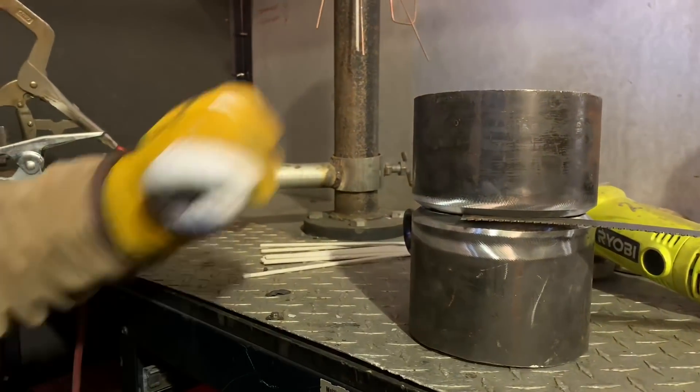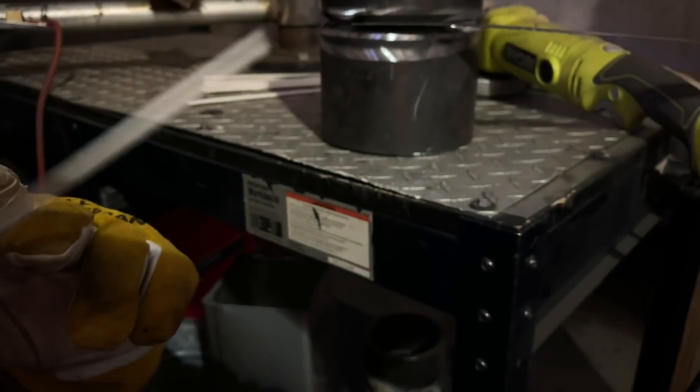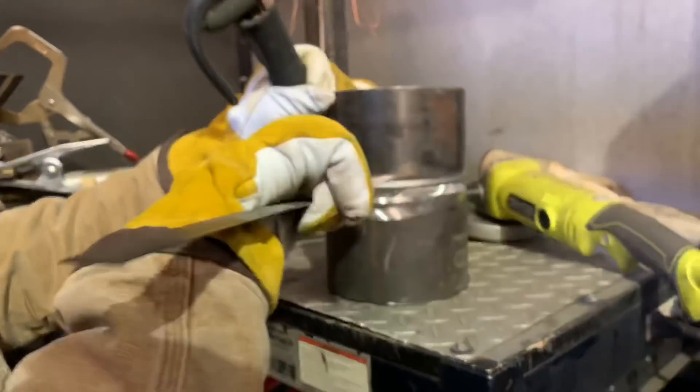As you can see, we're having some fun with it. Move your saw blade around as you're tacking — just stick a corner in there. You won't be able to get that saw blade out if you leave it all the way through the pipe. This drag method is by far the quickest, fastest way to put a root in on the 60-10.